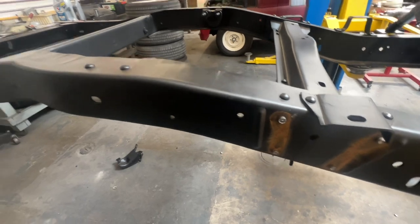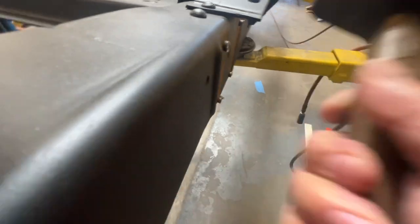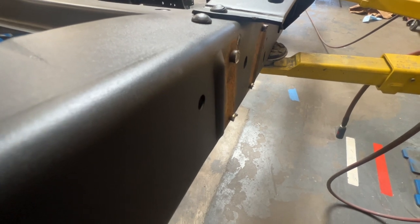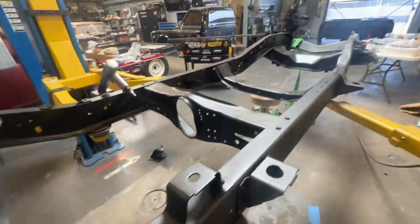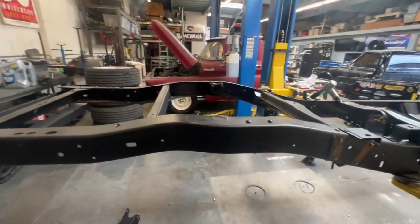These things are swedged up — I don't think they'll knock straight out, they'll just flare. So I like to grind them flat and then use a round punch to knock them straight through. Let's move back up to the front — I just buzzed all these off while I was on a roll with the air chisel.